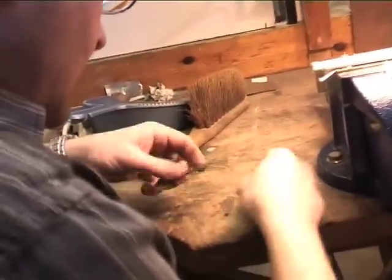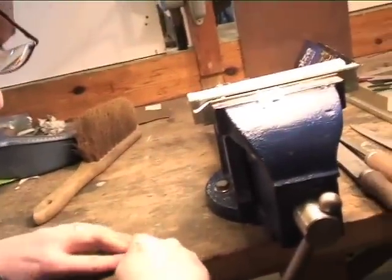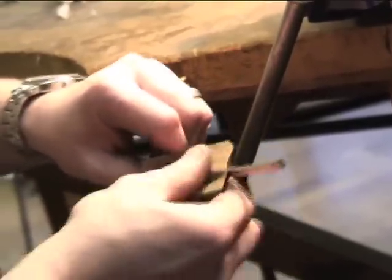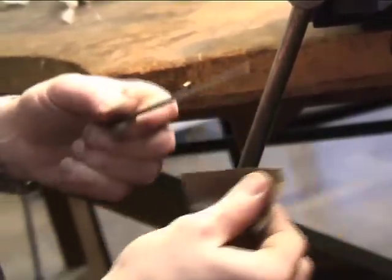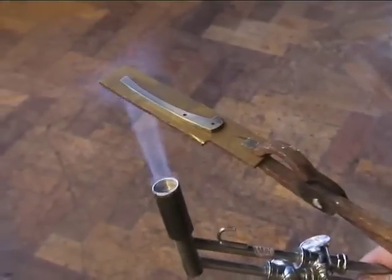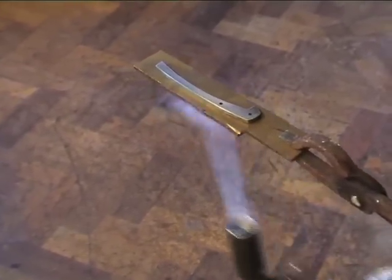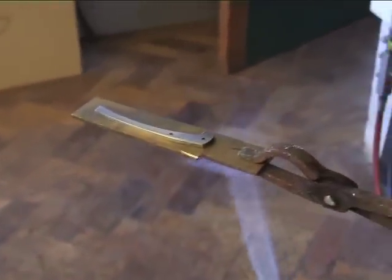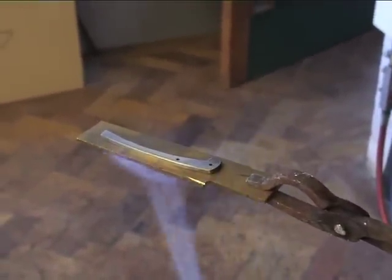You're only cleaning up to see the temper color. That conducts heat really well, the brass. So the heat will be uniformly conveyed onto this. Then I won't have to compete visually with the effects of the flame to see what color the steel is.